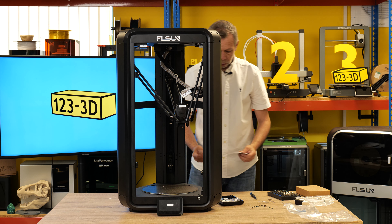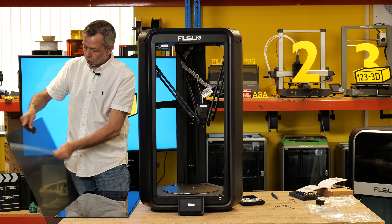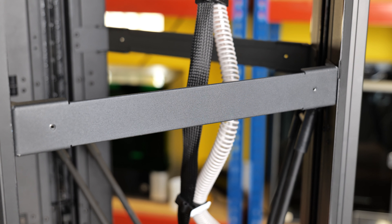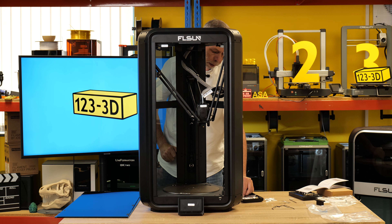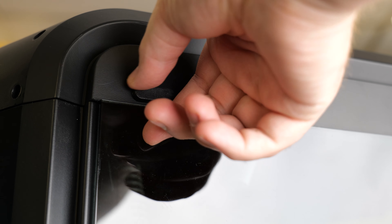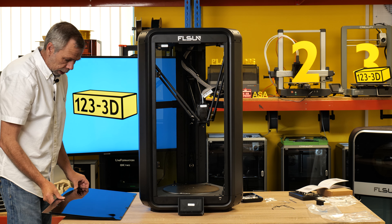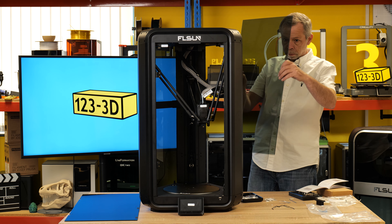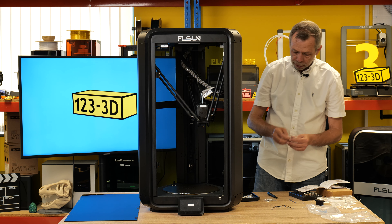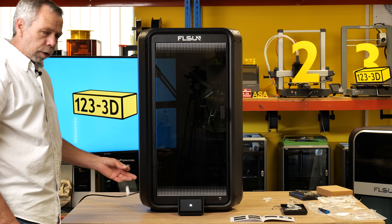It's now asking us to install metal braces — this is very fiddly. Braces installed. These are the perspex panels. They have protective film on, so I'll peel this off now otherwise I won't get it off later. The panel has two holes that line up with the braces we've just fitted, and we secure those in place — don't over-tighten or you will crack the perspex, just snug them down top and bottom. There's a little plastic lever to twist and lock the tops and bottoms into place, making that side of the enclosure enclosed. The middle piece — be very careful because that is glass. Pop in the little gasket, then install the door handle from the opposite side. And there we have power.